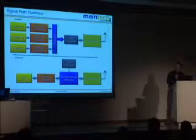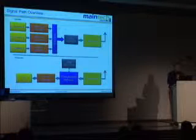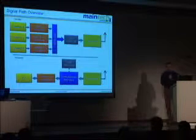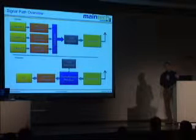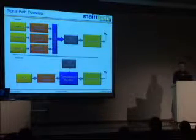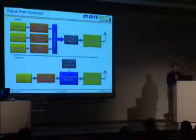After that, our work comes, the modulator. The modulator has the job to transform the bitstream into the radio frequency signal by breaking the packets up into bytes, and after that, adding error correction, and then breaking it up into single bits and modulating them on the carrier signal. After that, the antenna comes, and that's where our responsibility ends.